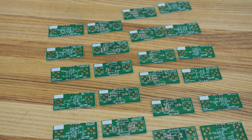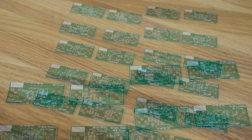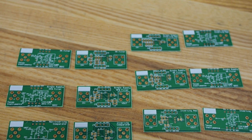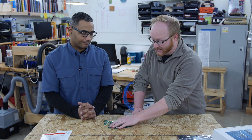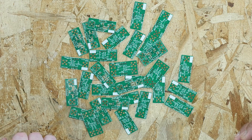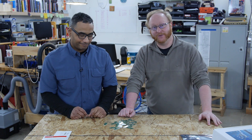It's a really great set of miniature PCBs for developing amplifiers — surface mount and nicely done. Similar to breakout boards used for SOIC-16, TSOP, and other packages, this is the same concept but optimized for amplifiers, providing the best component placement and minimizing transient noise. This is the SOIC-8 version, with SC-70 and SOT-23 versions also available. These PCBs will be handy for any future amplifier design work.